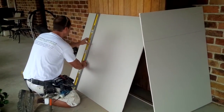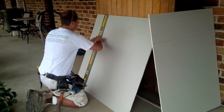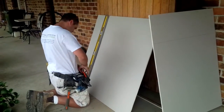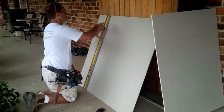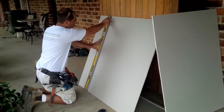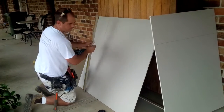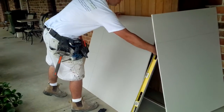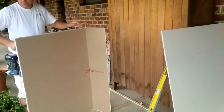And then what you do is you snap it, and then the paper on the back, you just slice that through once, and you should have a nice straight cut. You have to cut it through all the way one way and then cut your other dimension the other way. And then you should get a nice piece of gyprock. Try and get it as close as possible to the size of the hole when you're doing this, because you will have to fill any gaps over about 2 millimeters to prevent cracking when it's plastered.